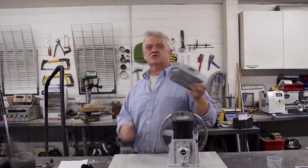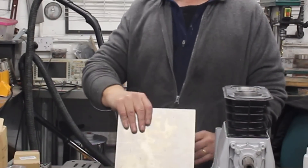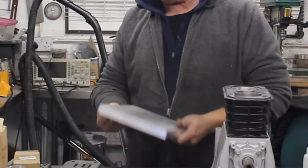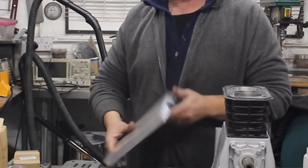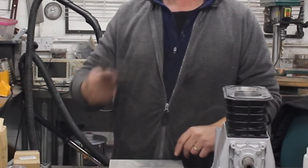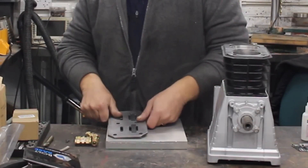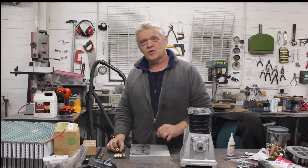Although I do think that catalogue is a little awesome. Anyway, let's get on with it. In order to make this adaptation, most of the work is on the cylinder head. Rather than a lot of tedious mucking around with that cylinder head, I bought this — it's a block of engineered aluminium, which means it's got one flat face. It's 20 by 20 centimetres, two centimetres thick, and I need to drill a few holes to bolt it on top and drill some ports in. This is the valve chest that came off. If I superglue that on there, I can use that as a guide for drilling my holes, then drilling a couple of holes and popping in these eight millimetre brass fittings meant for house plumbing. We've got ourselves a new cylinder head with ports.